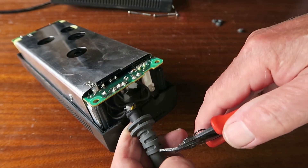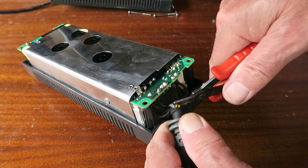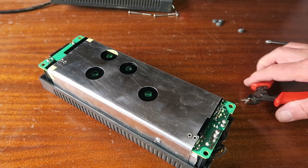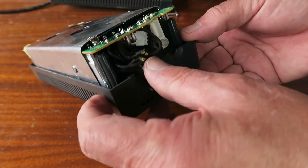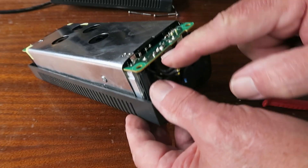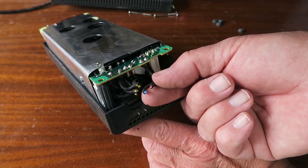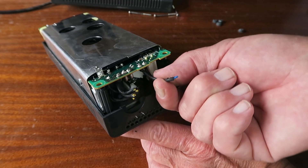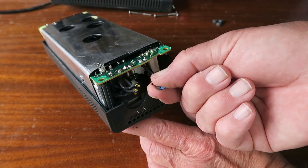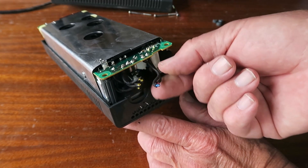You can strip the original cable back and use those wires if you wish, but personally I prefer to cut them close and replace the whole thing. Similarly, you can either twist these cables together and use them, or unsolder from the top of the board. The red and blue wires here are sense wires, which would normally go to the Xbox to enable the 12 volt output. You can either just twist those together or bridge the solder joint at the top, which is what I think I'm going to do.